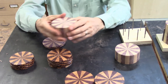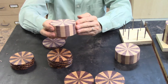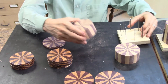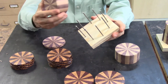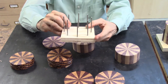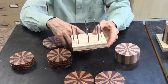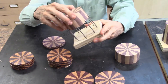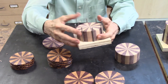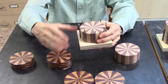What I did was I made some more segmented discs. After they were glued up I took them and put them on my edge sander and ground off the edges to make them perfectly round. Then I made a jig which consists of a piece of three-quarter inch plywood. I put my disc on there, traced around the outside of it, and on my drill press I drilled holes exactly the size of these nails — I think they're 10-penny finishing nails with the head ground off — so they'd be perfectly perpendicular to the plywood. My disc fits in here nice and snugly, so this will be a glue up jig. When I cut these discs into thin wafers, put them on here with the epoxy cement and clamp them down, they won't be able to slip and slide — they're fixed in place. This jig should give me much better results.